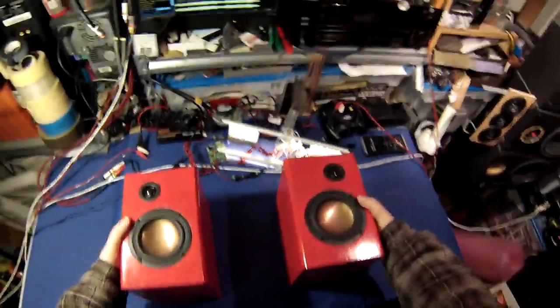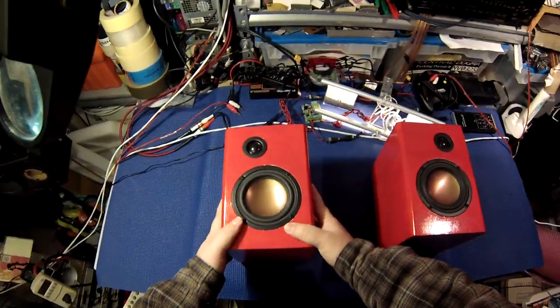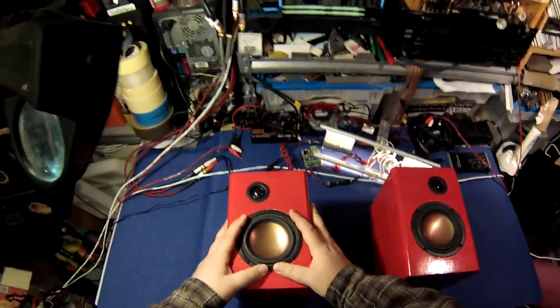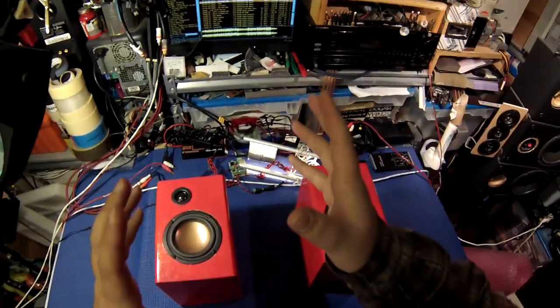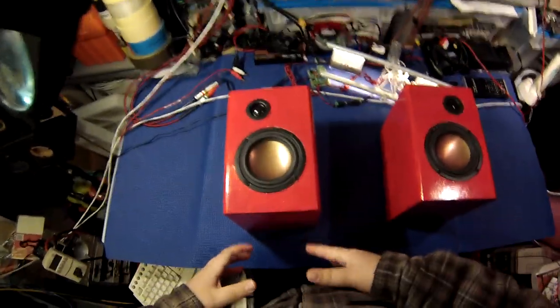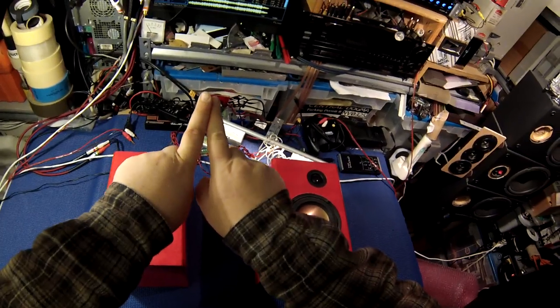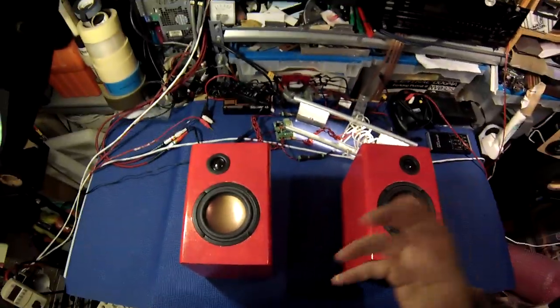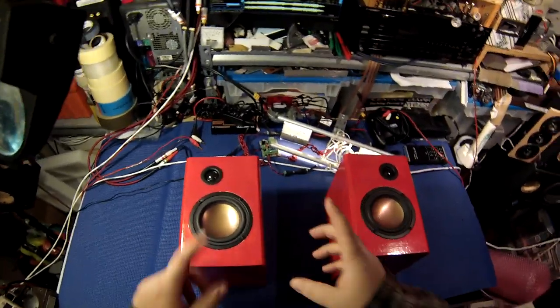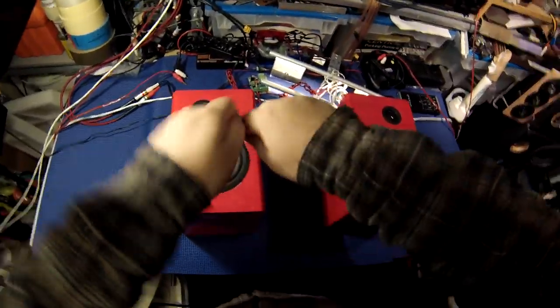With these speakers, because they were built in a rush, the finish is obviously not 100%. And I had to pull one apart — I had to pull this one apart because on certain sections of songs there was a resonant sound. I was like, what is that? Did I break the speaker? His crossover is assembled with components soldered up in the air, and because they were sticking up, little pieces of metal were acting like tuning forks at certain frequencies — very, very precise frequencies. So I went in there and just twisted and bent things down and it stopped happening.